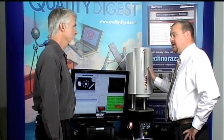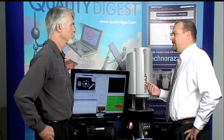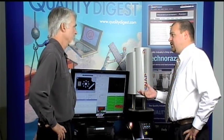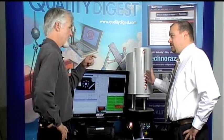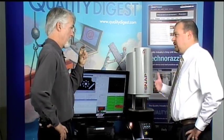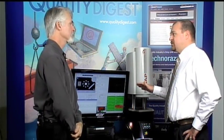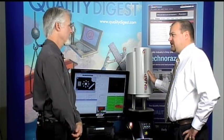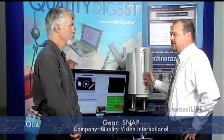The digital measuring machine is a little different from a video machine in that we don't have any moving elements — the stage doesn't move, the optics aren't a mechanical zoom, it's all digital zoom. We have a large field of view of about 78 millimeters and a very deep depth of focus of about 38 millimeters, so you can measure a fairly thick part from top to bottom — up to an inch and a half — all in focus. We have a telecentric zoom system, applying technology from our comparators and video lines in a large-format measurement system.